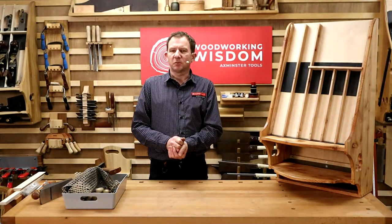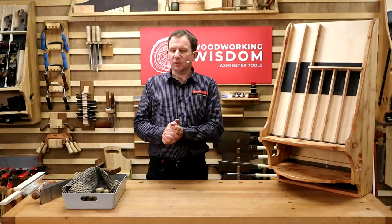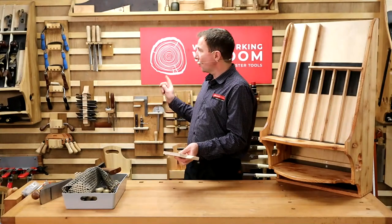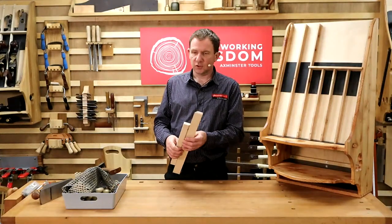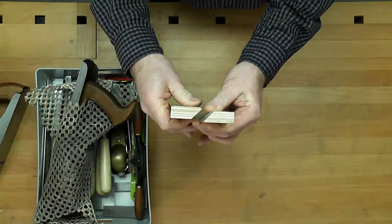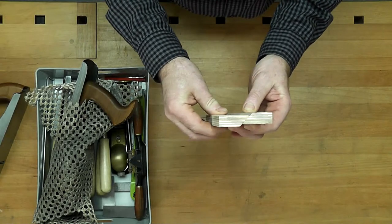That related to what we had to do in the rooms. In here, the whole of this wall — and it's a bit longer than you can see — is purely hand tools. One of the things we looked at was a French cleat system, so we made it out of plywood. The first thing we actually did in the room here was board the wall behind us with plywood — fixed that on nicely. We then cut some birch plywood into rectangular strips and cut it in half at a 45-degree angle. The beautiful thing with this is one bit goes on the wall, the other bit onto whatever you want to hang. They interlock — so it's fantastic.